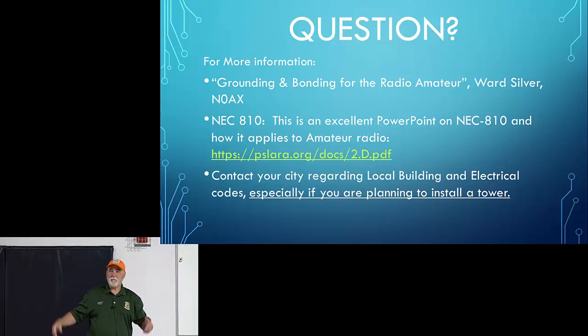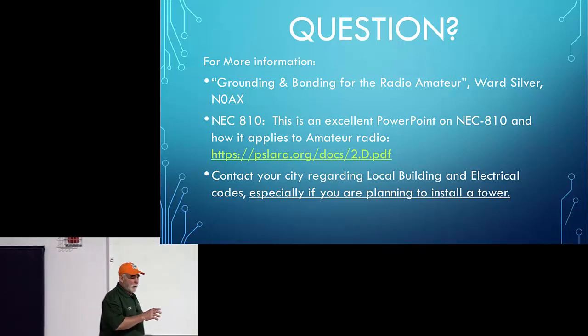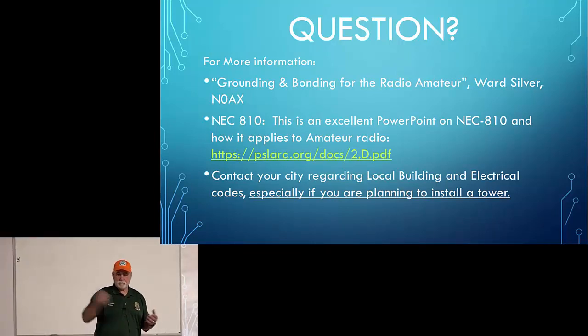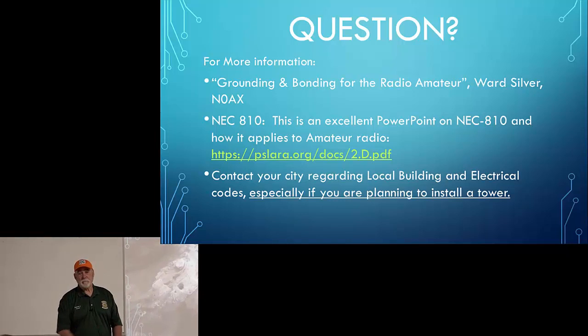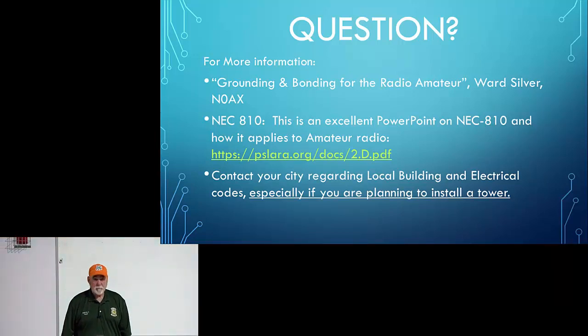Continuous flow through, so you get maximum power transfer from the transmitter to the antenna. Right, maximum transfer. You want all the watts your rig is capable of putting that RF into the antenna. That would be the case especially on a long run of coax. Say you're 200 feet from the rig all the way to the antenna, you put an auto tuner at the antenna so that you don't have that cable loss back and forth as you're turning that signal around.